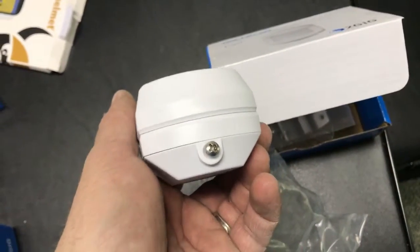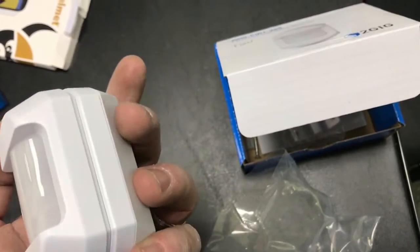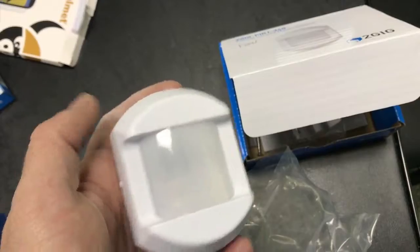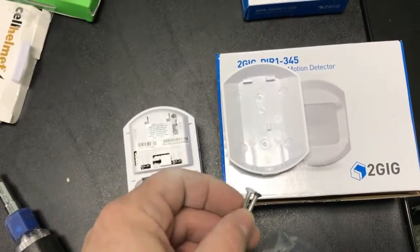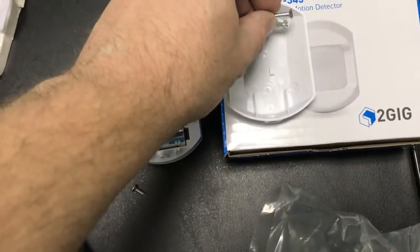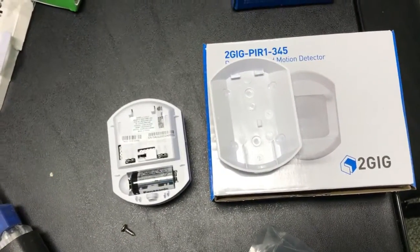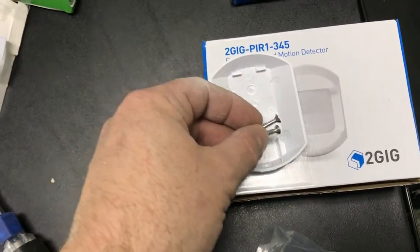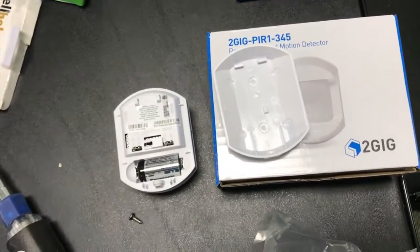What you do is take that screw out first, and then you're going to place some screws on one side, both top and bottom. That way it doesn't make the back tweak if it's just a little bit off. When I've got the back off, I like to take the two screws that come with the motion detector and screw them in here and here. To make it easier when I get up on the wall, instead of trying to screw it in there, I'm going to screw it into the box just barely through the plastic right here, and then they'll be ready to go when I put it up on the wall.